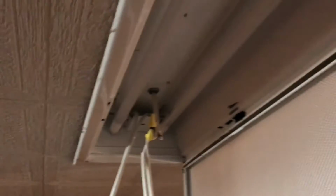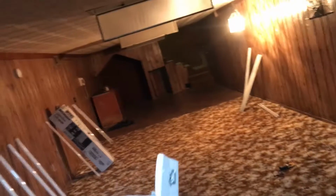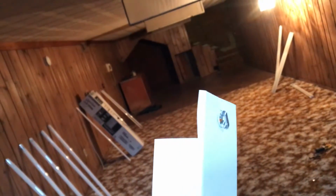You can see these LED lights are in, and they're wired to the 110 volt source coming in. Now we're ready for the ballast cover, and we wanted to show you this. We couldn't install the ballast cover without it interfering with the wire from the light. So what we had to do is notch them out to give some relief, so that they wouldn't ride on the wires. And right here you can see where we have completed an assembly.